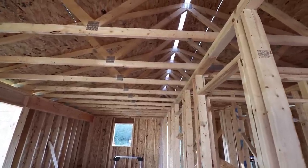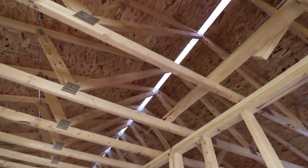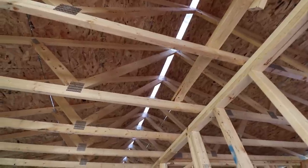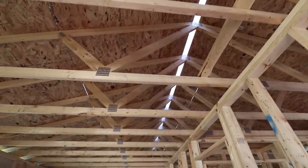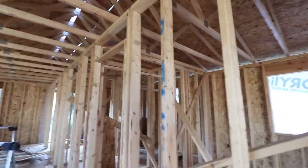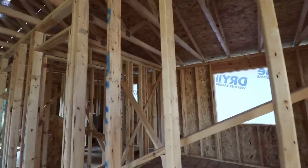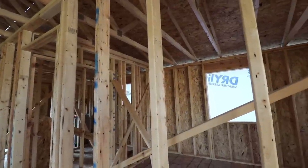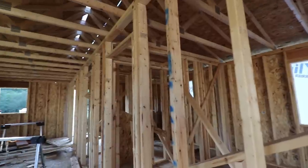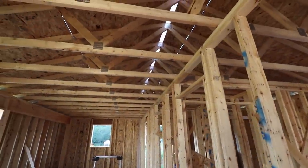But I wouldn't do that until I'm going to do siding. So that's up there for now, but I have the membrane going right over it, so that can be waterproof for now. And I think that stuff up there has, I don't know, a 90-day UV rating. The house wrap that I'm putting on the outside has a 300-day. I doubt I'll get it sided before winter either, so it'll be fine. Look at that back addition on the tent. All that is house wrap that I painted, and it's been there for years and I've never had any trouble.